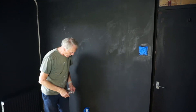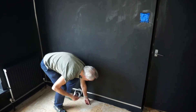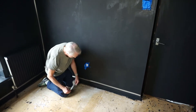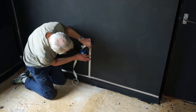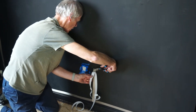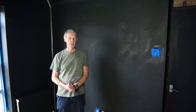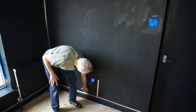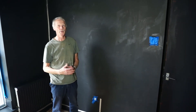I've got one more thing to do with the tape — bring a bit from here up between the four holes we made right at the beginning, so that the earthing plate will go over that tape. Get a good overlap at the bottom, bring it up and cut it off. Now when the earthing plate goes on, everything will be connected to the earth. We're now ready to put the next coat of paint on, painting over all of the earthing tape. Let it dry, then put the final third coat on as well.